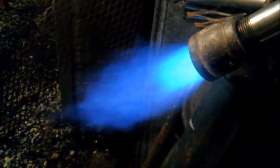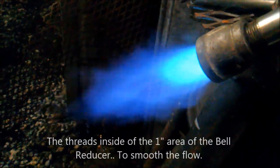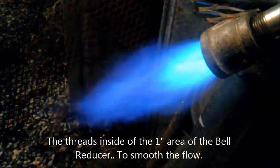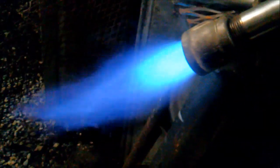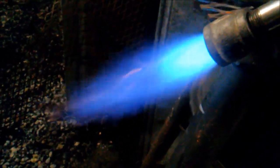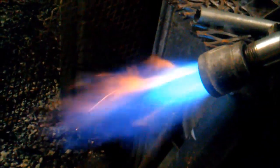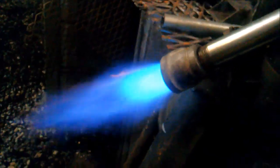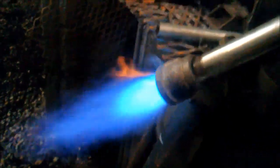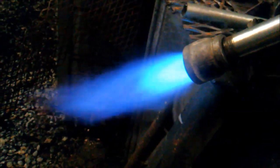There's a little bit of yellow flame in there, but I think I'd have to drill those threads out to keep that from happening. That's a pretty decent range, no pressure. I think I would have to drill those threads out on that three quarter to one inch reducer in order to get a smoother flame.